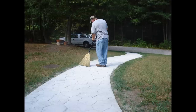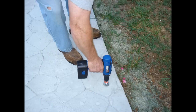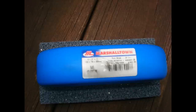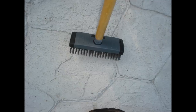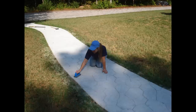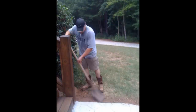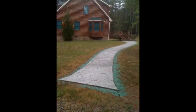We had to let the concrete cure through the rest of August and September, but we did keep it clean and swept. We even took a drill and a little wire attachment, a sanding brick for concrete, and a wire brush with a handle, and knocked off the rough spots that were left behind by the stamp. After taking up the form boards we filled in with some dirt and sprayed some smart seed because they were calling for a few thundershowers — and I sure am glad we did that.